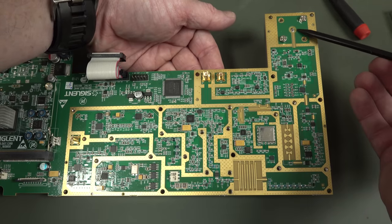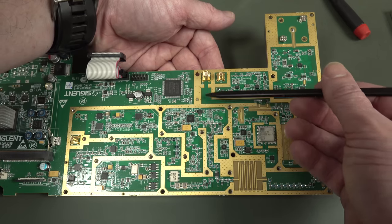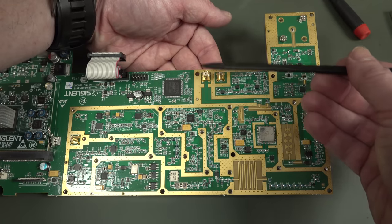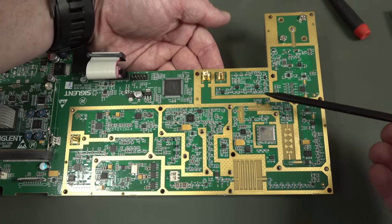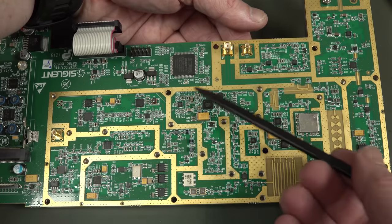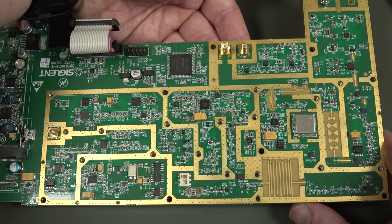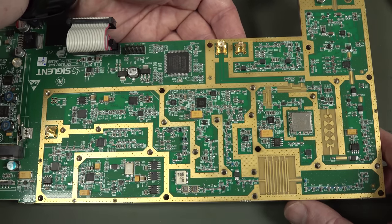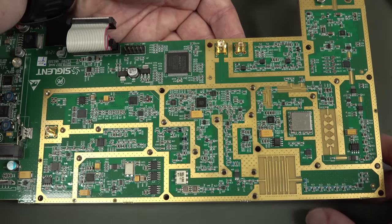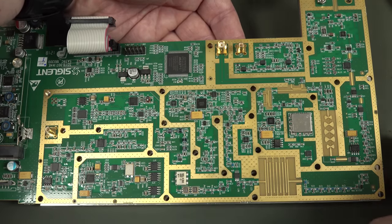You can see the signal flow from the RF input here, through the various sections. It's tapped off with that distributed element filter, and I suspect that's where it's going back. We're tapping off that, which we probably didn't have in the previous version. You can just see flow through the various blocks - I've gone through it in quite some detail on the previous one, which is like a 40-minute video going through the architecture of a spectrum analyzer like this. High-res teardown photos are over on eevblog.com if you want to see for yourself.